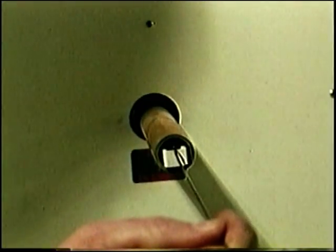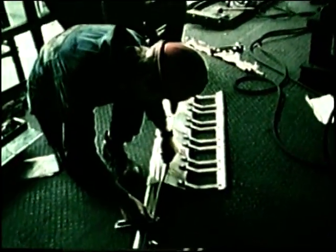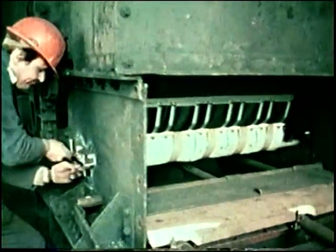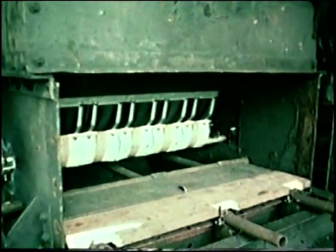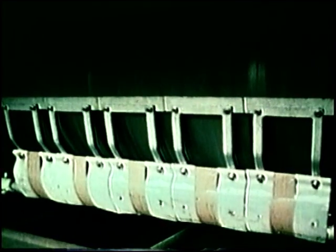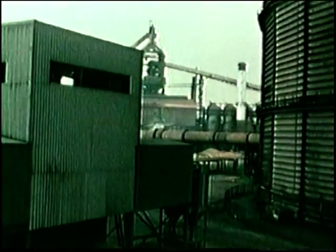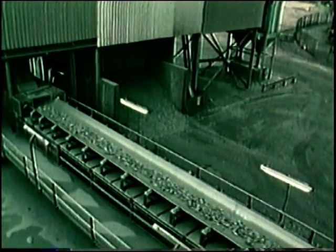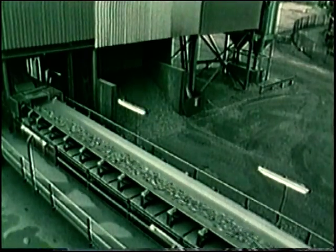The scraping angles and tension of belt cleaners are very critical. The geometry is carefully planned. The overall width is cut to suit the conveyor construction, to allow full adjustment to the blades for accurate alignment and blade pressure. Each installation takes on average 4 man-hours to complete. When a scraper is installed to Hoverdale's specification, a guaranteed working period of 10 to 12 weeks is expected without the need for any maintenance or adjustment.